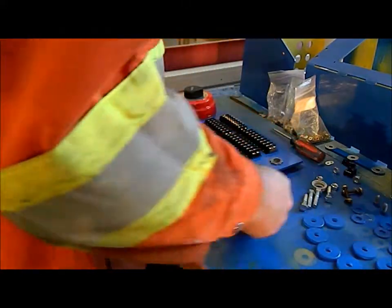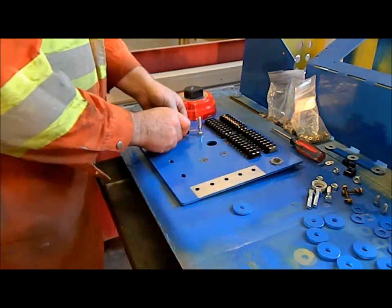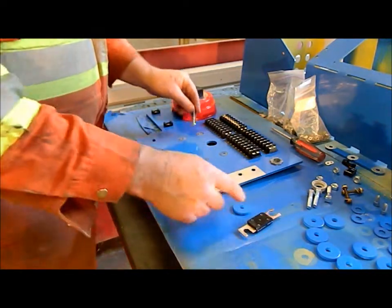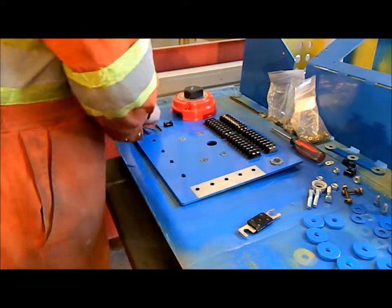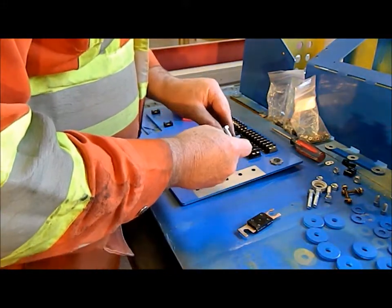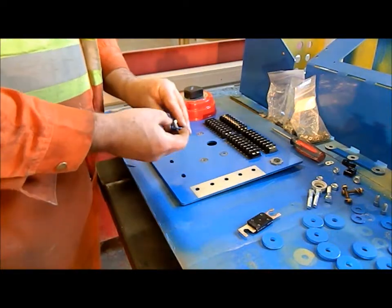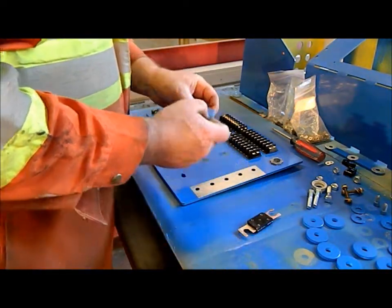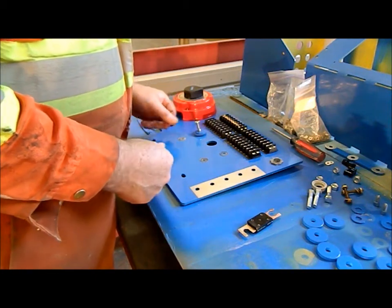All right, then on, again, that's just to insulate the bolt. The bolt will go through like so, and then the fuse holder, of course, fuse goes on like so, yeah? So we're going to go like, that's painted on one side. We need this. These are washers. I just painted one side of the washers, and a metal washer, then the plastic to insulate it, and then it'll go through like so.